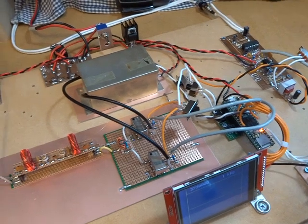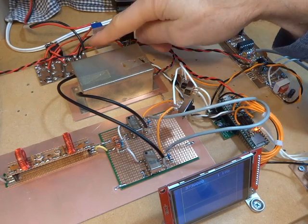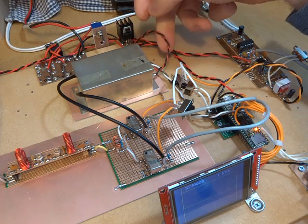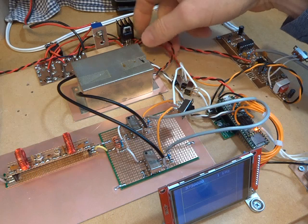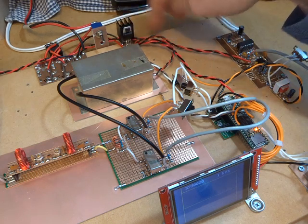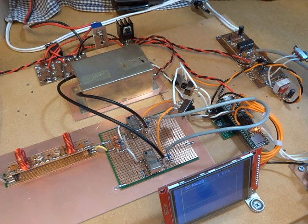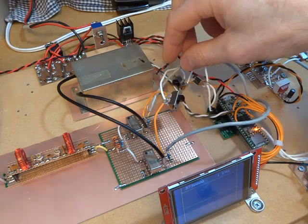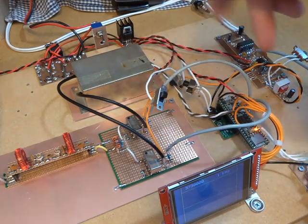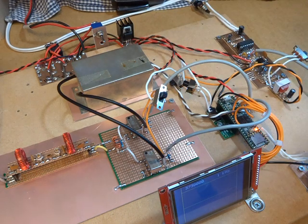One option for the encoder noise may be to run different voltage regulators. This is a 5V voltage regulator dropping our 13.8V down to 5V, providing 5V for the SI5351 and 5V for the TNC. One potential option is to have two of these — one dedicated to the SI5351 and one dedicated to the TNC. That may be something to explore later on. I'm certainly curious and interested to hear from anybody who has had encoder noise issues and how they got around that. On the last few radios I've built it was way way down — a little bit of noise but absolutely totally swamped as soon as you get any atmospheric noise or normal RF coming in, so it's just a non-event.